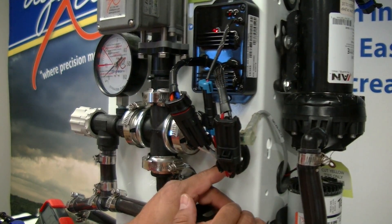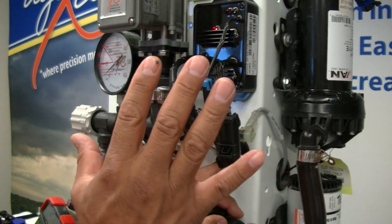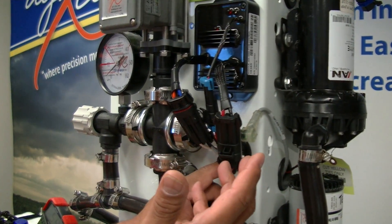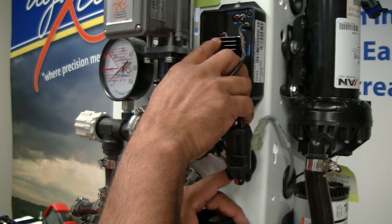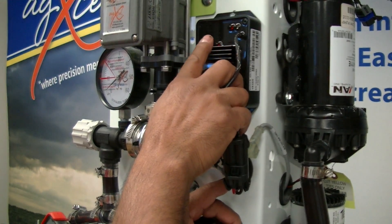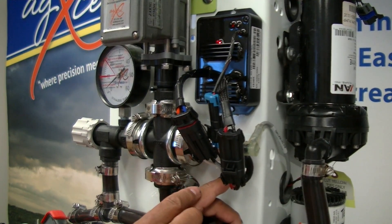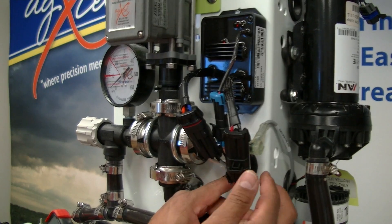You may notice that in the morning it takes off and runs fine, and then all of a sudden everything goes off. That's usually a sign of a voltage issue. When you come back and look at the light, you'll probably see four flashes and then off. So one of the first things you do is check all your connections.